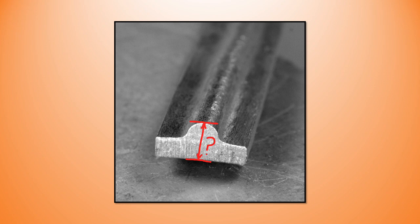I'm not quite sure what I'm trying to achieve. So for me, this is what I do. I take the bead and I say that's about 1/3 of the width of the collar material. So I cut this into thirds. It's 1/4 of an inch tall, so 1/3 of that is about 1/16 of an inch. And then I add that to the thickness of my back strap, which is 1/4 of an inch, to get an average of 5/16.